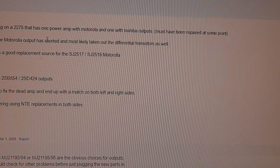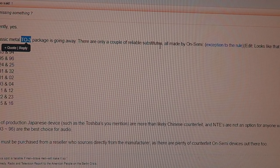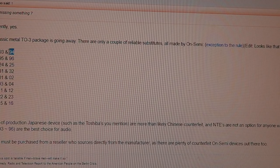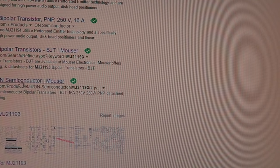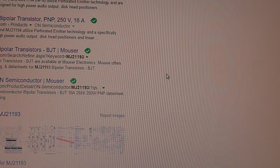There's a great thread on the Audio Karma forums. A user named Echo Wars posted a summary of classic TO-3 transistor substitutes — the TO-3 are the big cans, not the small TO-220s I mentioned earlier. The only reliable substitutes are made by On Semi. You need matched pairs: MJ21193 and MJ21194. People in the thread say that top set is the best to get; you can find them at Mouser and similar suppliers. We've got them on order and they should arrive this week.